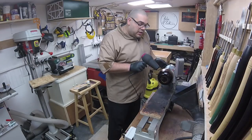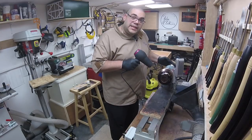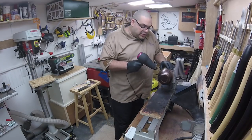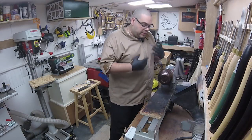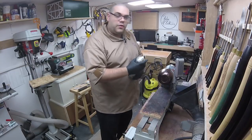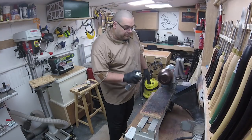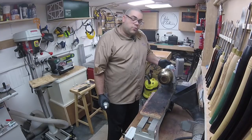What I'm doing now is just using the hair dryer just to blow it around a little bit. And this is what helps to give it the pattern - you want to continue to use the hair dryer until it's all completely dried. Now what I want to do is apply a coat of lacquer - this is just regular car lacquer that you can pick up from any car shop. You can do this with the lathe running, but you want to do it quite slowly. I've got it about 150.